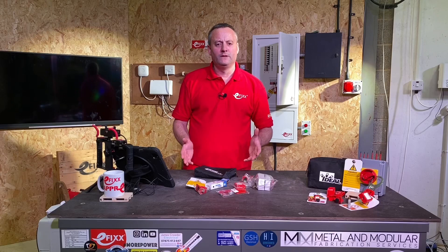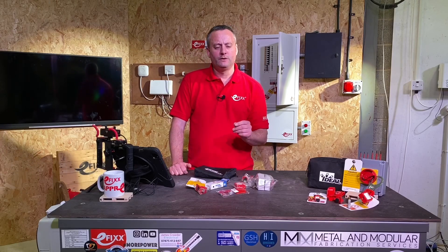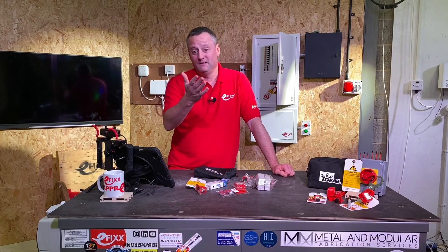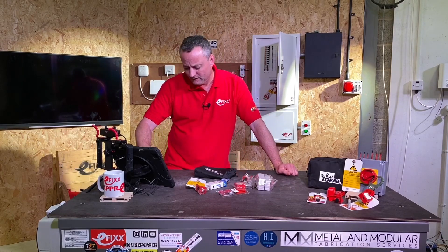Simple — I like simple ideas that are easy to use so there's no barrier to it. We can easily clip it on, whether it be the universal or the pins-out device, to secure a circuit breaker in the off position. We'd obviously go through the safe isolation procedure, and if it turned out to be the wrong circuit, we'd unattach it and move to a different circuit — all stuff familiar in the electrical industry. The pins-out device can also be used on the main switch of the consumer board behind me.